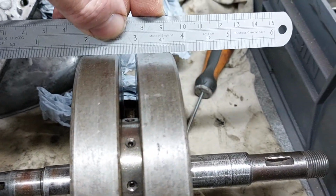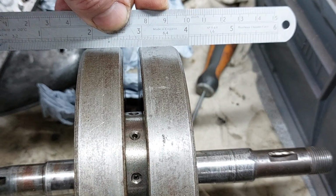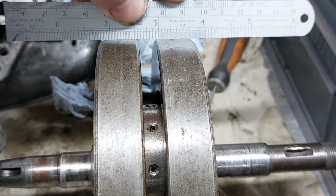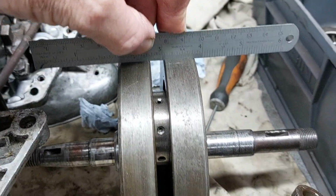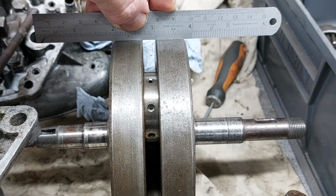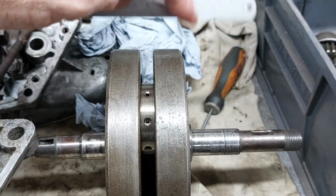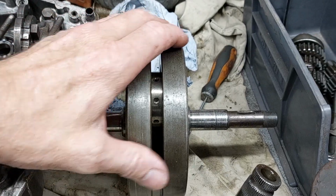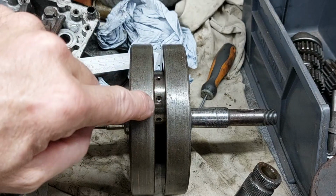I don't know if you can see there, but if I just put it there, you can see it sits flat on this one, on the right hand side. There's actually a gap under the left hand side, and it gets worse depending on where you move to, where the two crank sides have been knocked out of true, and then go around the other side, then this one is higher than this side. So I can't demonstrate because I'm holding the camera, but yeah, so one of these has been twisted that way